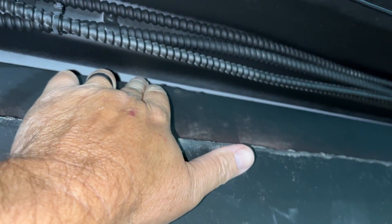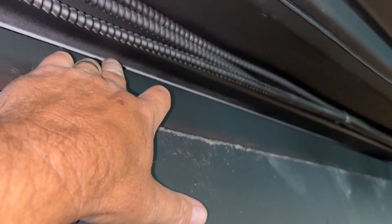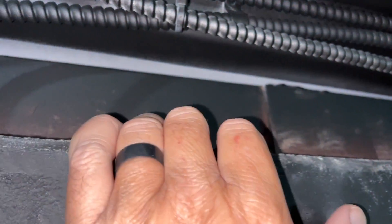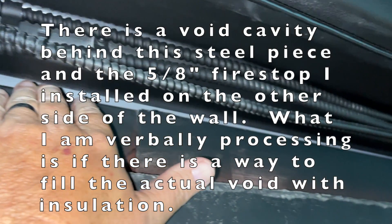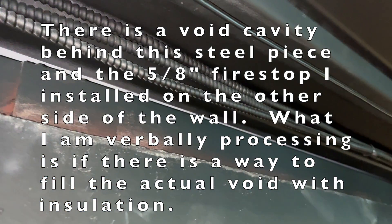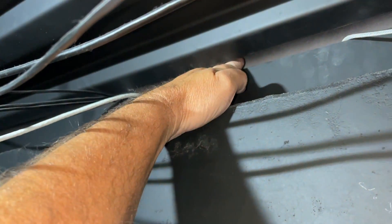Because I can't effectively get into this cavity — let me turn my phone light on so you can see how narrow that access is. I can't even fit my finger in there; it tapers down to less than a quarter of an inch. There's about half an inch of space in one spot where I can just barely fit my fingertip. While I could possibly inject some spray foam into this area, there's no way I can properly fill the whole cavity behind there.